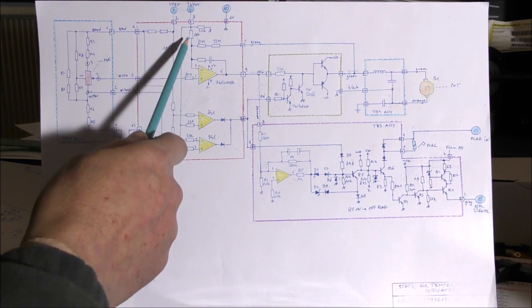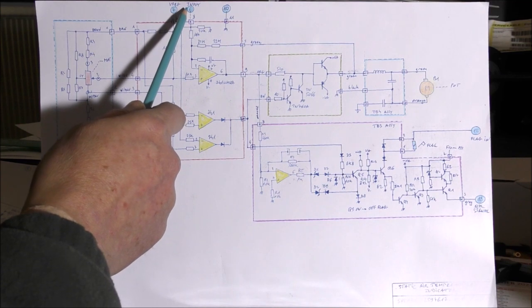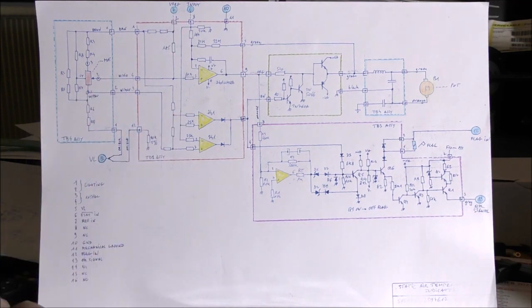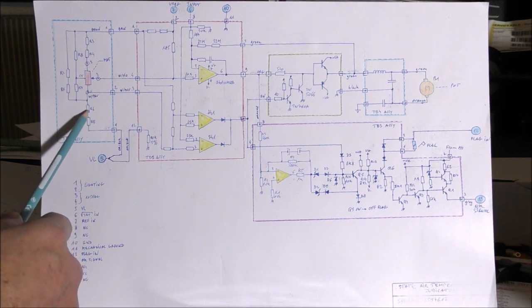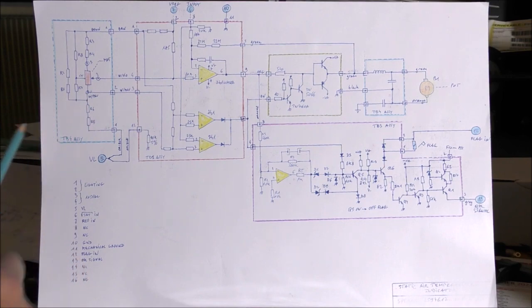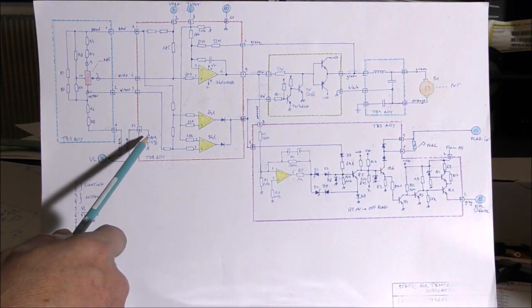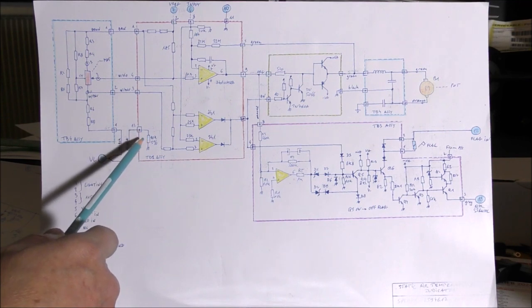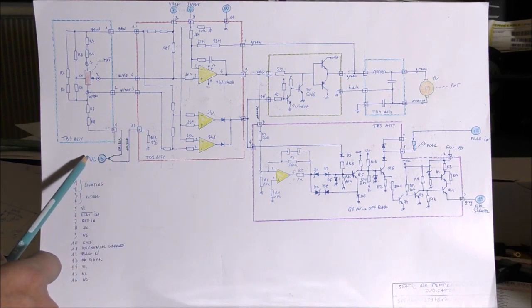The second input is connected to one pin here, pin 6 of the circular connector, which is obviously the input of that system. You can see that the low side of this potentiometer is connected to the ground through three resistors, these two resistors which are on that board here, and one resistor which is the carbon 5% resistor. So this resistor is not accurate and not stable at all. But this signal is also connected to one pin of the connector.